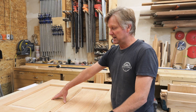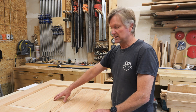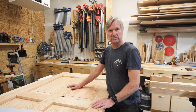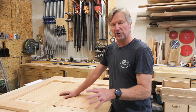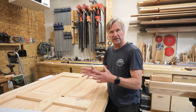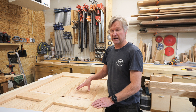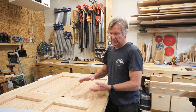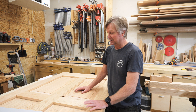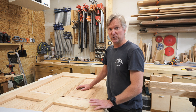If you like this video, give it a thumbs up, and if you'd like to see more content like this, please remember to subscribe so you don't miss any more videos. I hope this is helpful for anyone thinking of building an entrance door, certainly in climates like here in Canada. Try to think about wood movement and the differences in temperature and humidity between inside and out. Allow things to move rather than trying to lock it in, because if you try to lock it in, it's not going to work — the wood will do its thing regardless. If it wants to move, it's going to move.